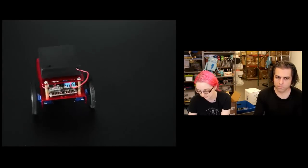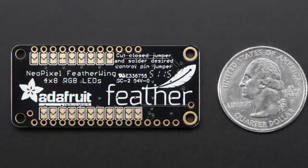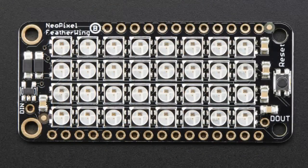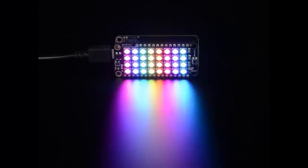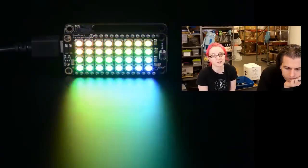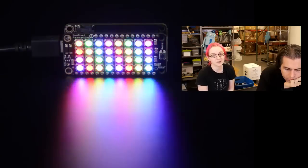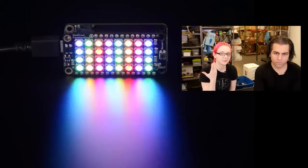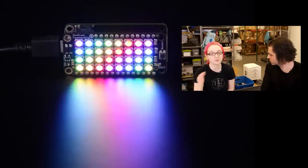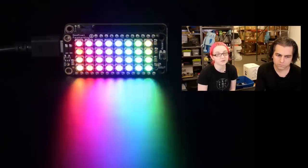Next up tonight, the star of the show — one of my favorite new products: the NeoPixel Feather Wing. I'm trying to keep up with my once-a-week Feather or Feather Wing, and I want to keep this party fresh. This NeoPixel Feather Wing uses super tiny NeoPixel-compatible LEDs — 3.5 millimeter by 3.5 millimeter. Originally I designed this to be 3 by 6 NeoPixels, but I saw the tiny ones and realized I could have basically twice as many because they're half the size. So instead of 18, it's now 32 pixels. It's got a power selector so you can power either from USB or from a battery, and it will automatically select whichever power is higher. It also has a logic level up-shifter so the 3.3 volt logic is shifted up, ensuring good control of these and other NeoPixels.